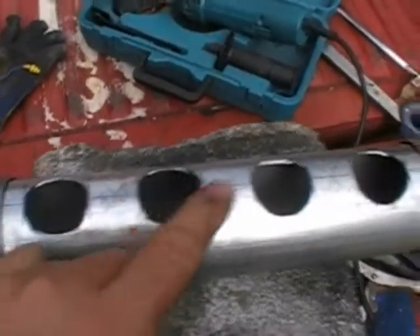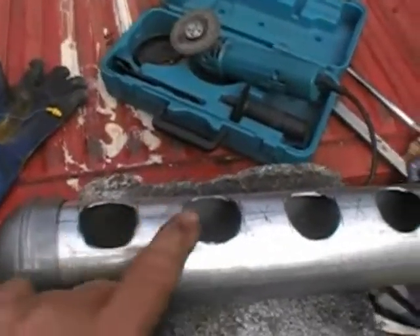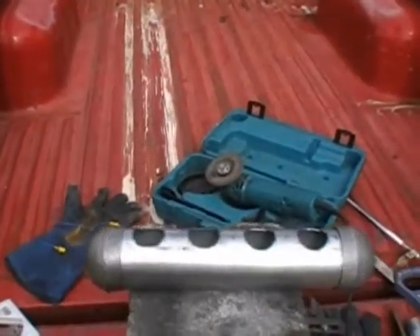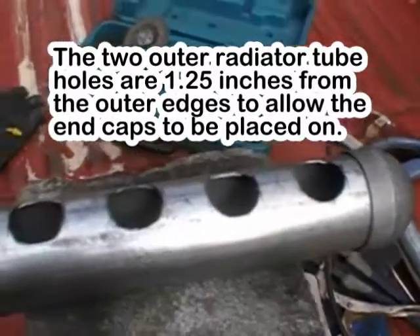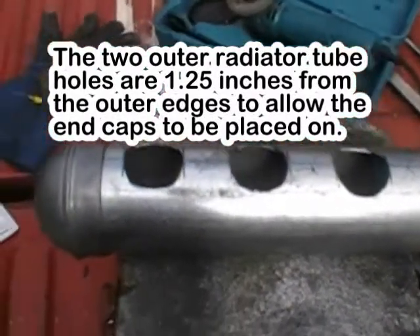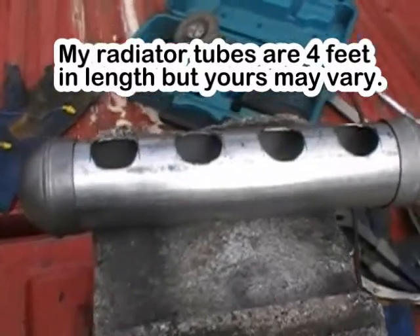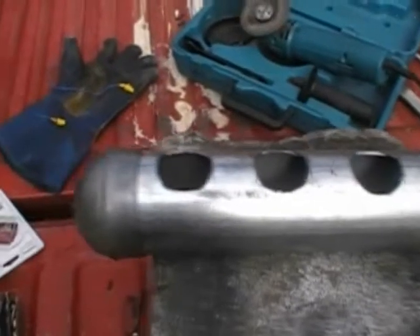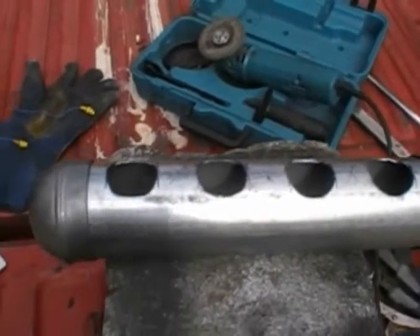On the bottom side, this is where the actual radiator pipes will come out - there are four of them. This is also fence post, one and one-quarter inch diameter - the stuff they run on the top of a fence to tie it in. I will not be MIG welding these; I purchased a small oxy-acetylene setup and I'm going to braze them in with brass. That's something I know how to do well, and since there's no major stress on these joints, I know they'll hold up.